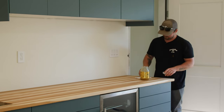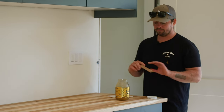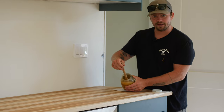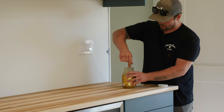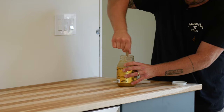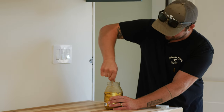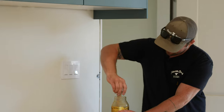We'll crack this open. I have my clean stir stick — I cut these off of off-cuts from our table saw, just a chunk of white oak, totally clean. Instead of throwing them away, I cut up a pile of stir sticks. We're going to stir this up. Like a lot of Odie's oils, it has a pretty thick consistency similar to honey. We want to get it really well mixed up until it's flowing a little bit better. When the jar settles it's a bit more transparent, and as you mix it up you'll see it become just a bit more cloudy. Now it's running off just a bit smoother off the stir stick.